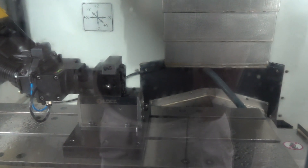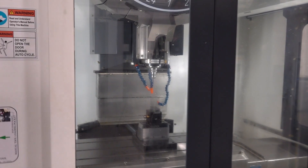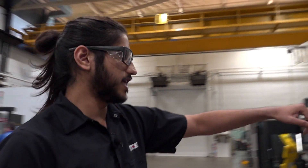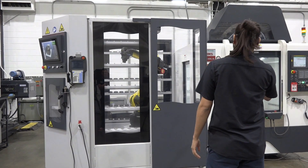In here you'll see it's set. It clamps in the machine, the robot pulls back, and then it'll execute once it closes the door and turns around. This program is different because it's a different part. While it's running, it will take the part that it finished and place it at the WSS for you to interface with. If it has any other objectives to complete in the cell it can do that while the machine is running.